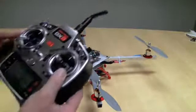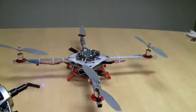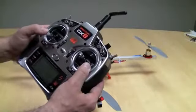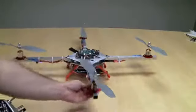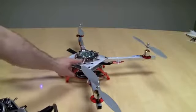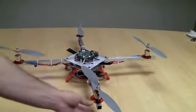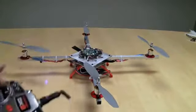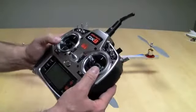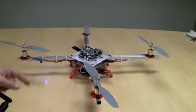When it's going through that arming process and I've got that solid red light, if I move it around, it's going to blink purple. And then it goes back to blinking green. That means the calibration it does when it starts up failed. So it's going to go back to ready-to-be-armed mode. I give it a left, right — I don't move it this time.